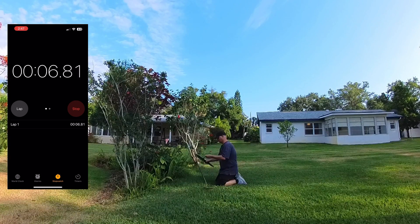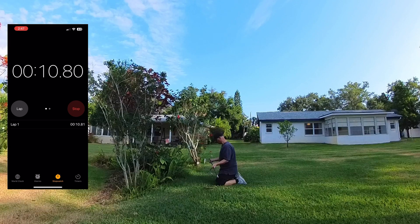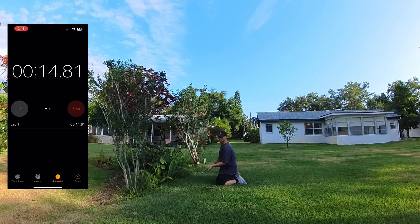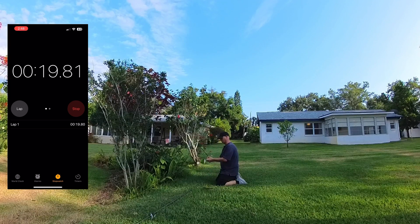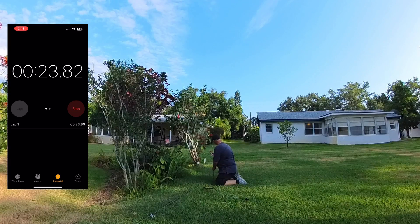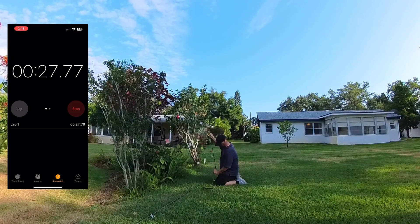This setup is broadband short to medium range, and it provides omnidirectional ground wave communication between 1.8 and 54 MHz, and in my experience, sky wave propagation on 40 meters and up. This setup requires the military whip, military extension, hybrid matching transformer, ground spike, coax, and ground radial.